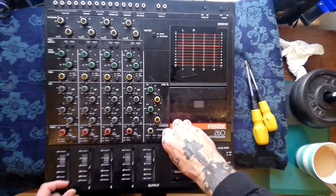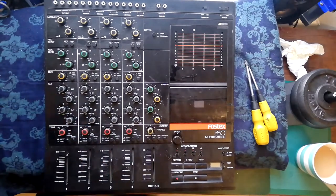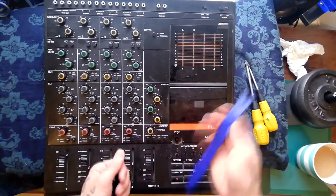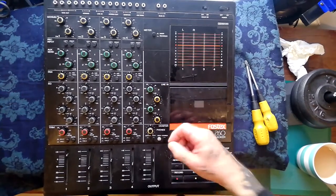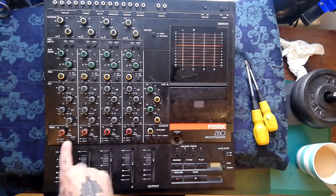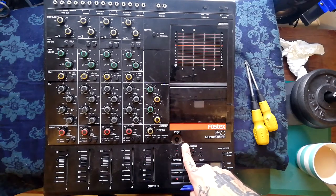It's really just that and the pitch control that I'm expecting to come off from the front. I can pry that off. If you couldn't pry it off, just be aware it's going to pop off when you get this front case off. These push-push caps — if you pull them from the front they will come off, but actually it doesn't interfere with cleaning or anything leaving them on. So that's all I'm going to remove from this side.